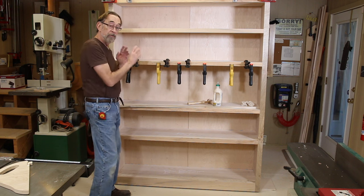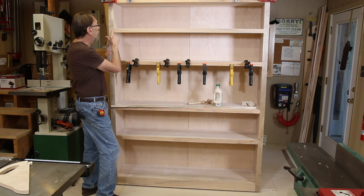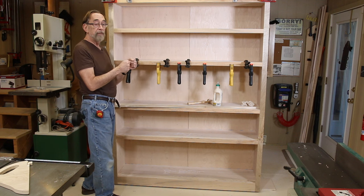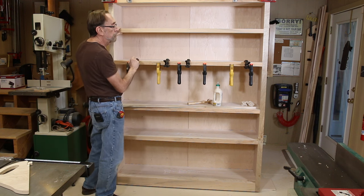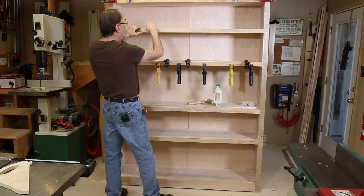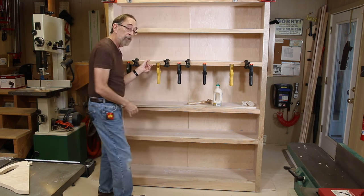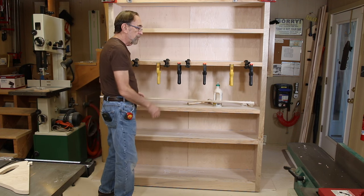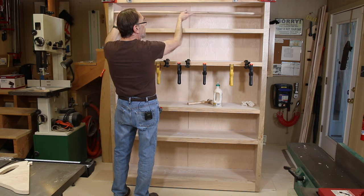I've been cutting the individual face frame pieces one by one and gluing them into place, so I can really sneak up on a perfect fit and get these edges absolutely tight. I'm cutting them at the miter saw a little bit long, then using my shooting board to sneak up on the fit until it's perfect. Once I get a perfect fit lengthwise, I glue it in place with the top exactly flush with the shelf. Once that's glued, I come back and glue in the under-brace, which goes underneath the shelf to give it rigidity, held with spring clamps. Now I'm ready to put in the final piece at the top.